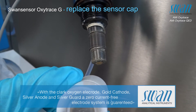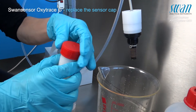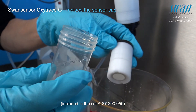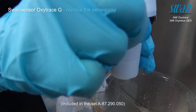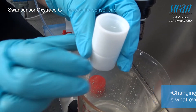If the sensor cap is defective, dirty, or enlarged, the calibration cannot be performed successfully. In this case, the sensor cap has to be exchanged. This can be done by simply taking out the new sensor cap from its container. The benefit here is that the membrane itself does not need to be exchanged, as it has already been integrated inside the new cap. This allows for simple exchange and guarantees proper function of the sensor.